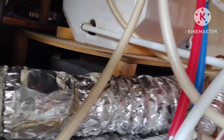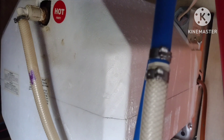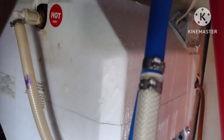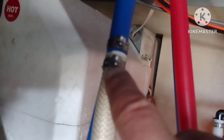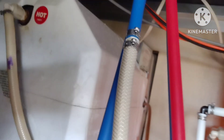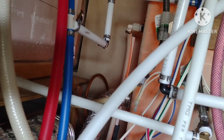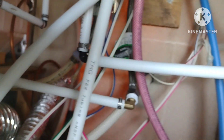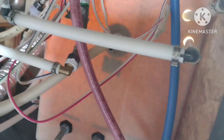There's still some more of it — here's a perfect example: the blue PEX cold water connection is fine, there's a PEX fitting there, but connecting it to this braided hose with a PEX clamp is not okay. I do not recommend doing that. Here's another one. That is the way they do it when they manufacture these things, and they seriously need to change their build model because that's not acceptable.